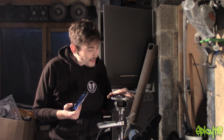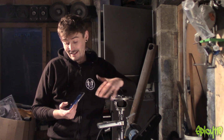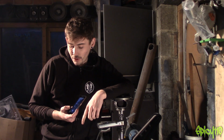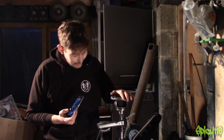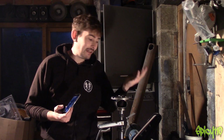Okay, well, that didn't go quite as I was hoping because basically this is such heavy gauge, as I said, that this welder was having a little bit of trouble getting the heat in there. I probably could have turned the wire speed down a little bit more, looking at the amount of the fill that went in to get enough heat into it, but it's welded, it's good, it's solid. You can't see these from anywhere unless you turn the clock upside down, so it really doesn't matter.